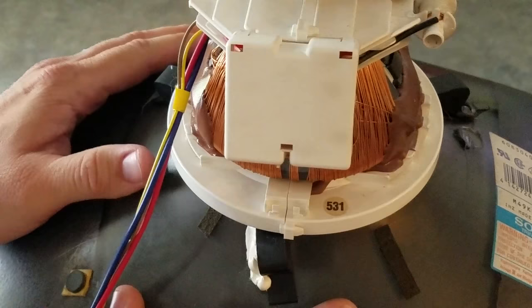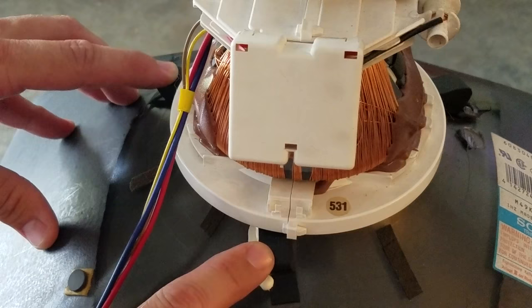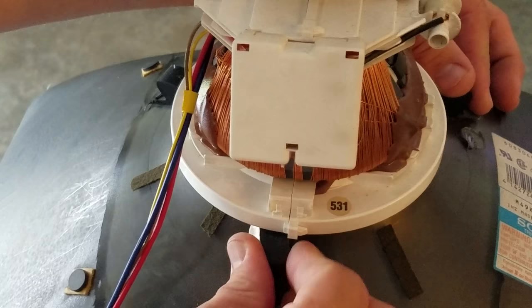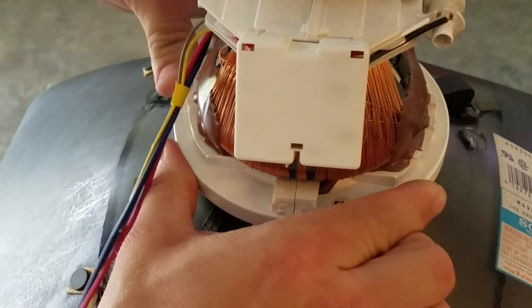that's what makes the screen look crooked. This has three points of pressure being put on this ring by these little spongy hard foam wedges. What happens over time is the epoxy fails — they wiggle and move, your yoke wiggles a little bit, and then it shows a crooked picture.